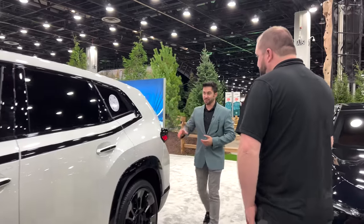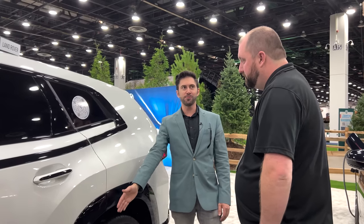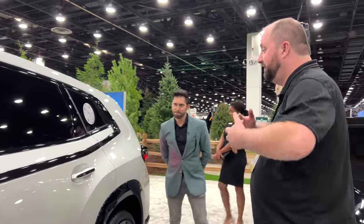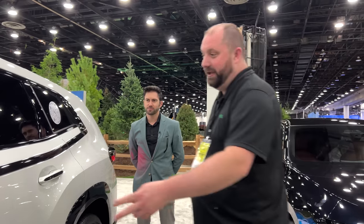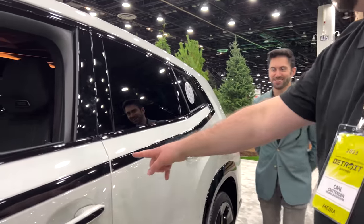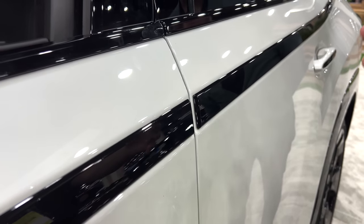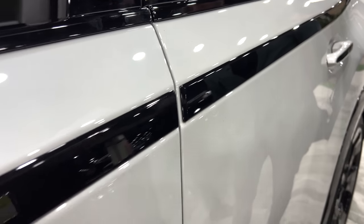It's not a functional bumper, of course. At least on the Pontiacs it was in an area that would receive shopping carts and things. Nothing's going to hit you up here. Whenever I was working with designers and trying to develop the actual part, on the designer's screen this band would be continuous. In reality, that band is not continuous — it stops before the edge of the door because you don't want that trim piece to be the protruding component, as it could get nicked. So now you have to have the body color visible between those two pieces of trim. That happens multiple places across this vehicle. The designer who wanted a nice continuous line now has broken-up line segments, which is not reflected in their drawings.